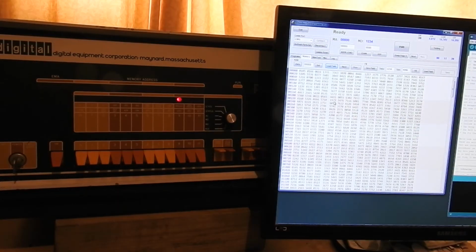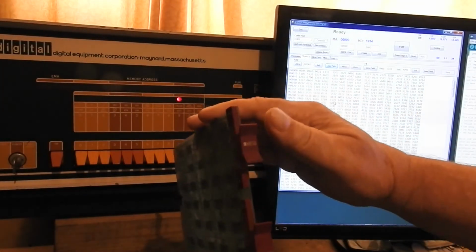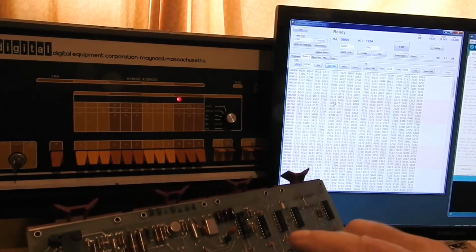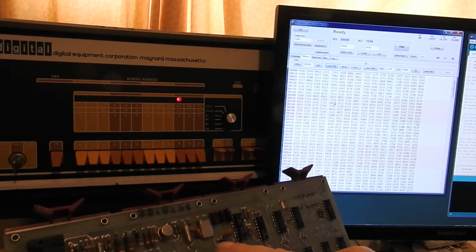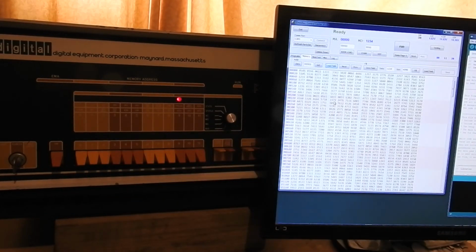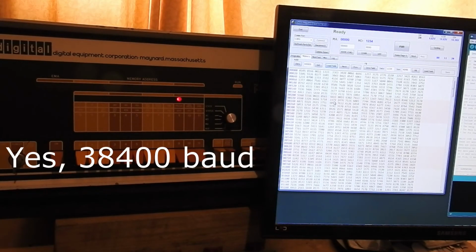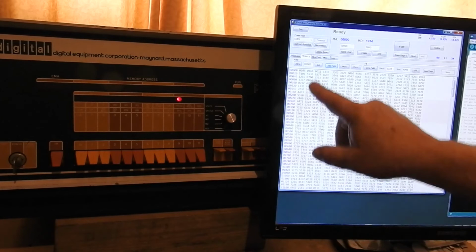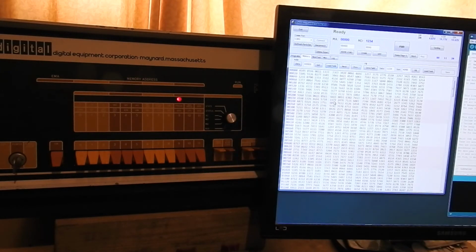I don't know. So one way I want to sort that out is this M8650 serial interface. I want to make the mod that allows it to work much faster than 110 baud. Change that crystal there and cut this trace and put a jumper on, and then I can get it up to 38,400 baud, whatever, 38 kilobaud, and write a program to dump memory through this, so it's bypassing all this stuff I've done here, and see if there's still this memory issue, and then if there is, find out what's wrong with the memory. But I've done enough on DEX for now.